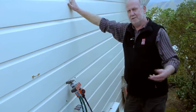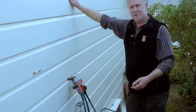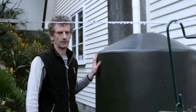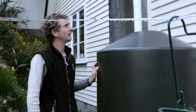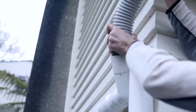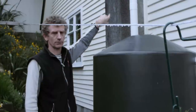By just unscrewing this little cap here we have 300 litres of fresh water. It's a very simple thing, costs very little to do, but if you're going to be renovating a system anyway, very worthwhile. I've also fitted a tank with a thousand-litre capacity on a little wooden stand, so we can put a bucket or container underneath to collect water coming off the roof, and I can divert it straight down the drain if the tank is full.